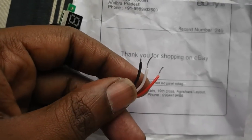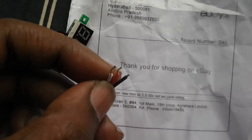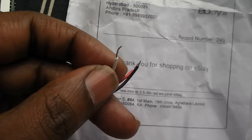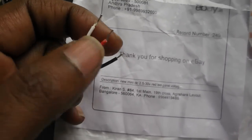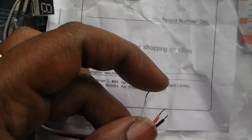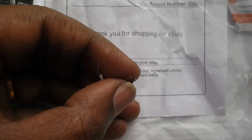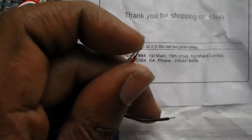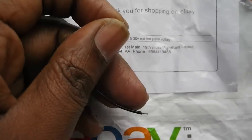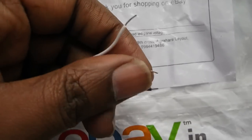It has three wires: the black one is common ground, the red one is the power supply to the module and can take up to 30 volts, and the white one is the voltage input where you can measure up to 200 volts. If you tie the red and white together, you get a two-lead voltmeter for batteries up to 24 or 30 volts. For higher voltages, you need to split them — one for power supply and one for measuring.